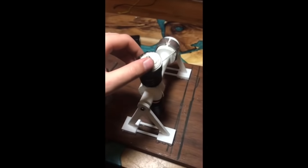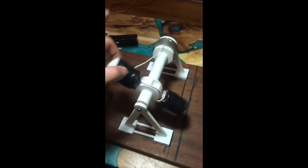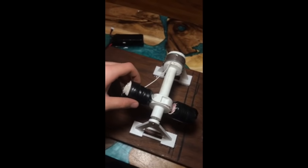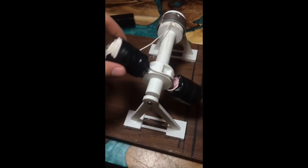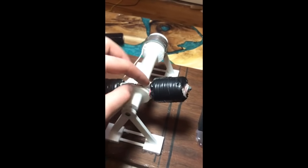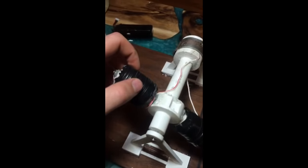Which brings me to the very important topic of how to wire this thing. You have to have the number of turns kind of match — it doesn't have to be exact, but it has to be close. You have to wrap them in the same direction. With this one, I started off with an end piece sticking out before I started wrapping it, and then I wrapped this one clockwise. As I started wiring the other coil, I left a pretty big piece hanging out so I could wire the two coils together — and they connect right there. I wired this one clockwise as well, and the end piece is screwed into the commutator.